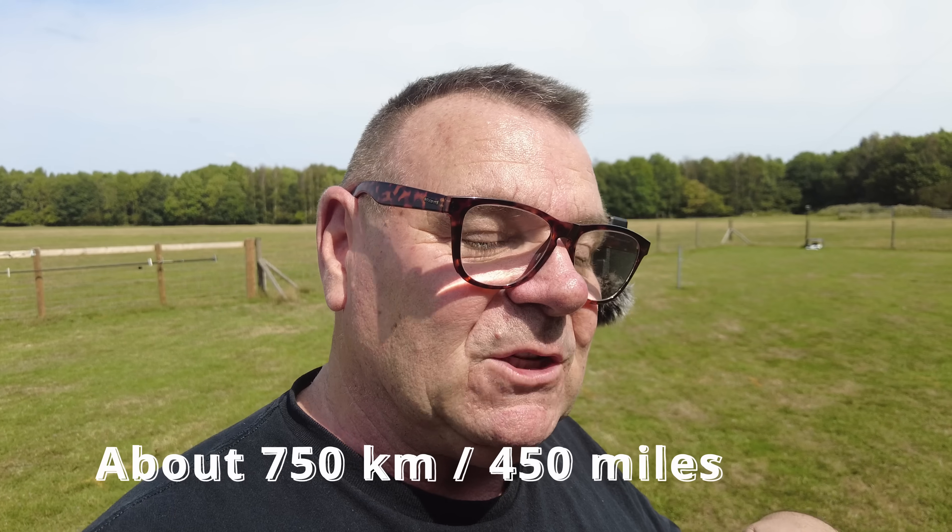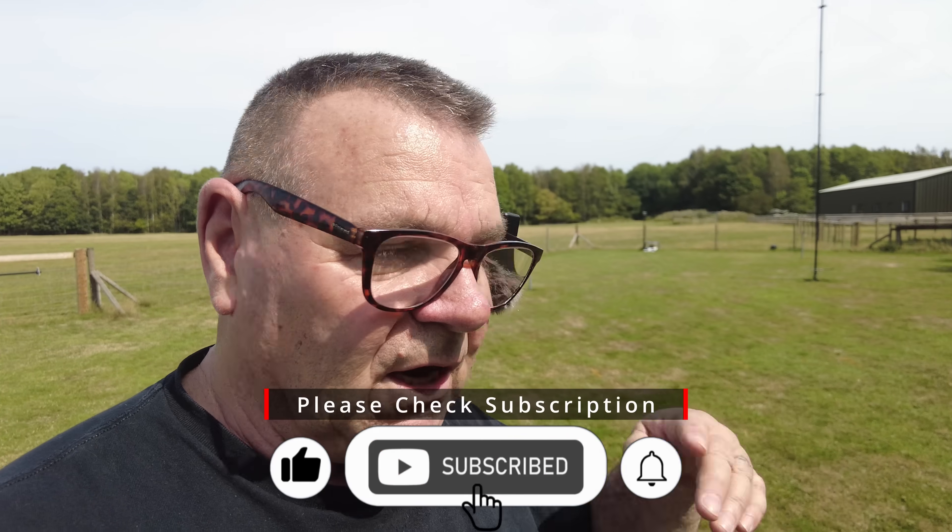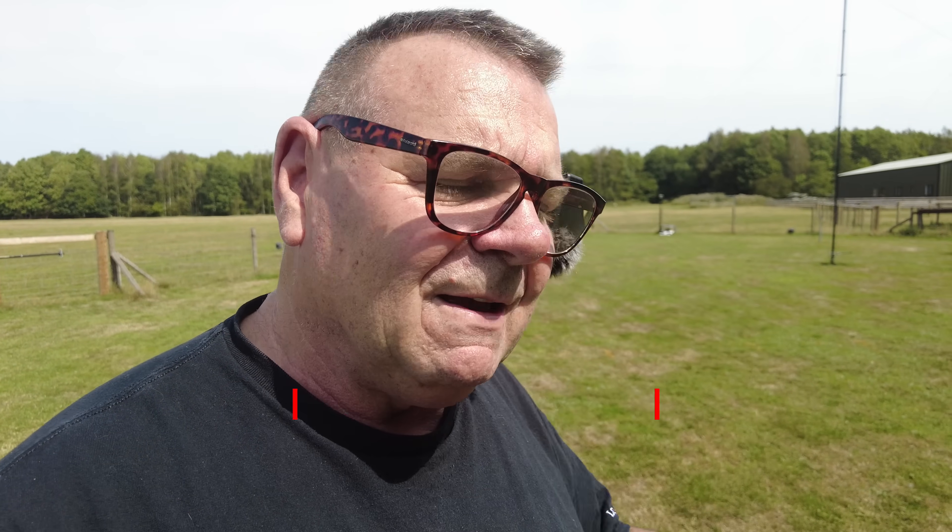Then we get into darkness — now your vertical just storms it and you're much stronger. On my live stream, Jeff in the Orkney Islands says I'm 10 to 20 dB stronger on the vertical than on the dipole. For you guys in the States, you probably don't use 40 meters like we do — 40 meters almost covers our whole country. In the States it's more local, until in the evening you discover you can go further because the D layer is melting away, allowing you to refract off the F layer.